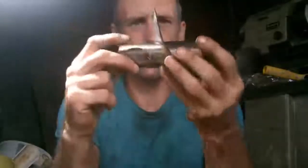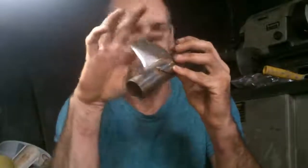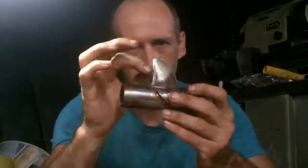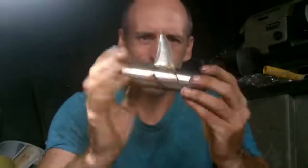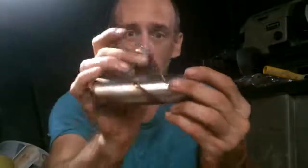These are the propeller blades I've been using on my boat. I took it apart - I first made these blades a little bigger than I thought they should be, then trimmed them down to the point where they were a little bit too small. I figured the size should be just a little bit bigger than that. I was hammering them a lot getting them into the right shape, and once I was satisfied, I decided to make some really good copies, because with all the hammering and bending they don't come out super smooth.